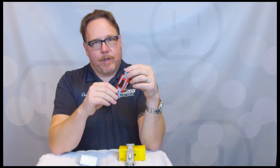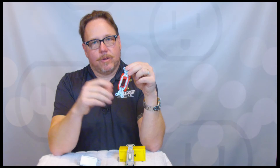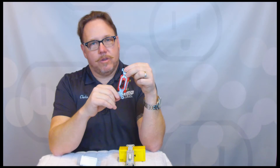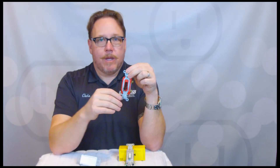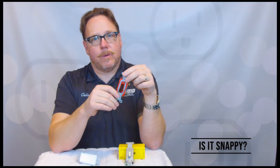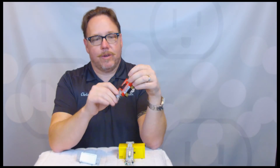Let's talk about a couple of simple ways you can identify issues with switches in your place of business or residence. All switches were originally referred to as snap switches, so you're looking for a crisp, clean snap. When you turn the device off and on, you should feel and see a crisp clean snap — just ask yourself: is it snappy? If it's not, you know you have lower end switches or they're prone to failure.